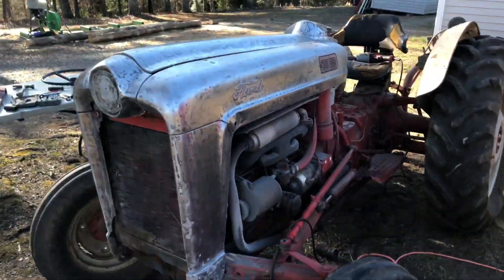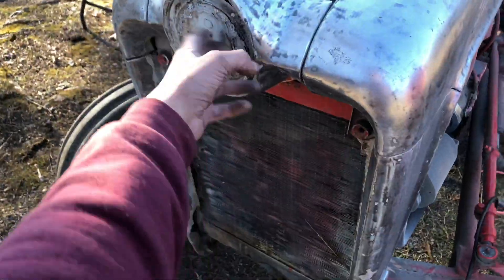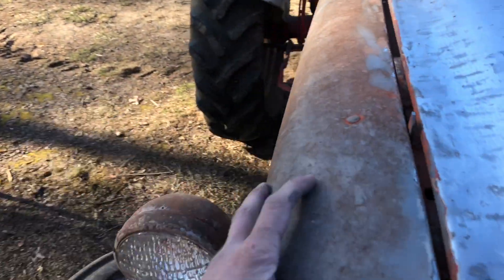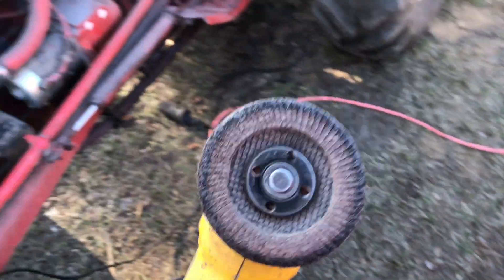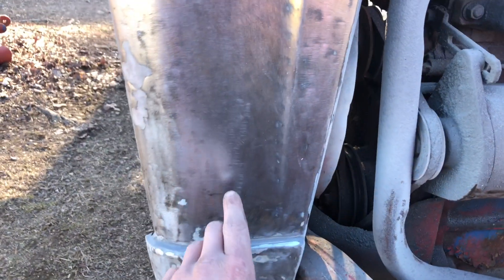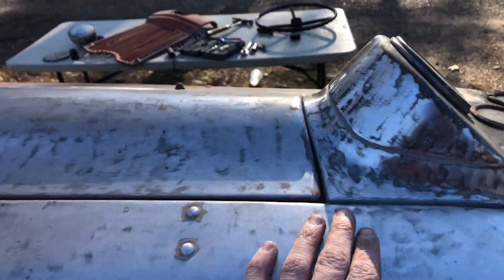As you can see, I've done a good bit of work since the last time I showed you guys. I took the steering wheel off, the light off, the grill and the bumper, and this little badge right here. I've got all this down to just bare metal on one side, but I haven't messed with the other side yet. The sander I was using was just taking forever, so I got this electric grinder with a sandpaper disc wheel on it — it just eats away the paint. It leaves little scratches that'll show up in the paint, but I just take the sander and it'll get the scratches out.